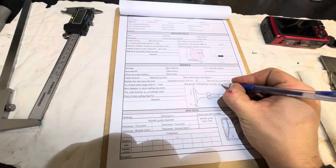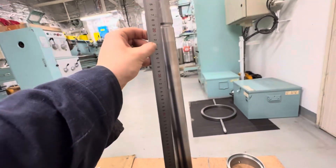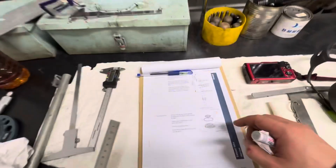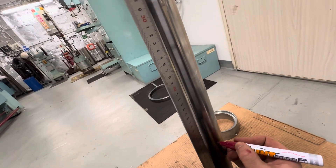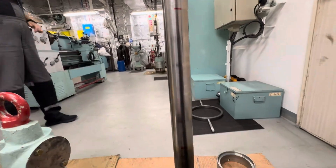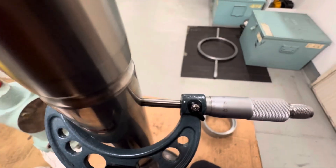Write the parameters in the company report form. Check the spindle stem for wear in the coated area, measuring from the top of the spindle. You can check in the data how much to measure. There are two points which need to be measured — the wear is very visible on the spindle. Take measurements using an outside micrometer.